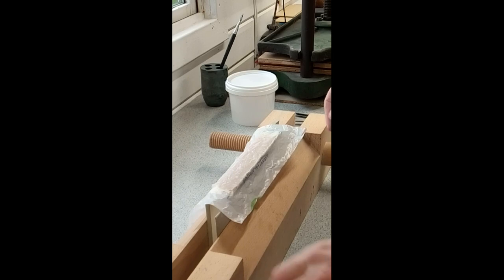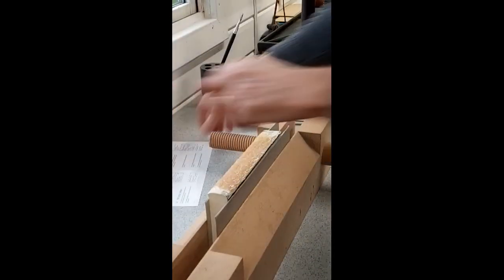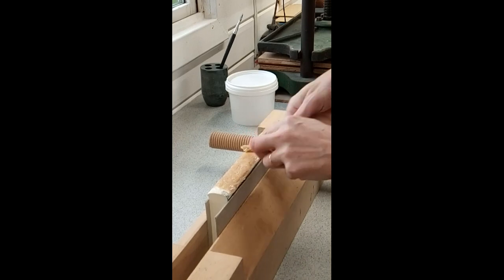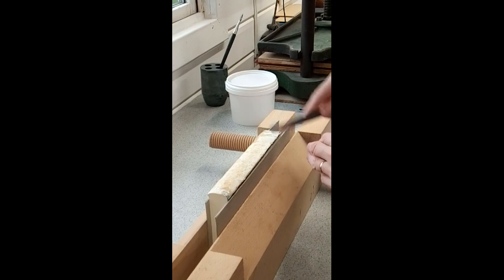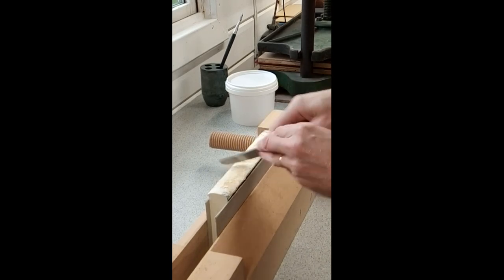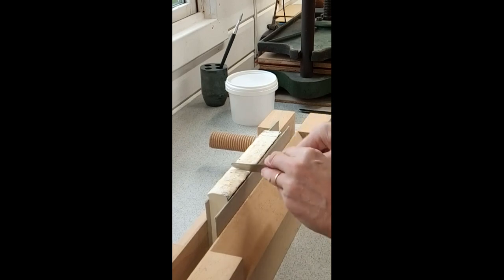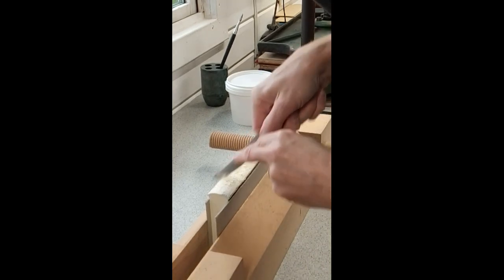That's been on there for about 10 or 15 minutes, so I'll take that off and get a bit of scrap paper for the glue and have a go scraping this off to see what happens. The brown lining paper is coming off reasonably well — let's take off as much as we can. Basically just about all of the paper has come off there, and what's left — the white — is essentially the glue. This appears to have one of the modern plasticised hot glues, which can be a nightmare to get off, but it's a good illustration of what to do.